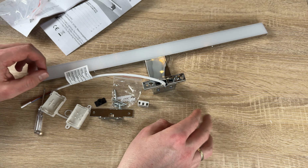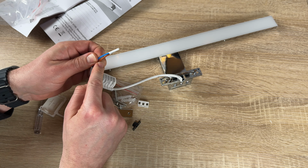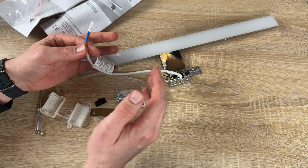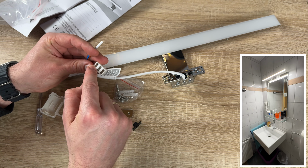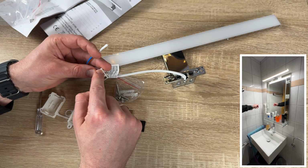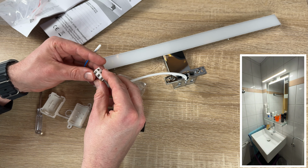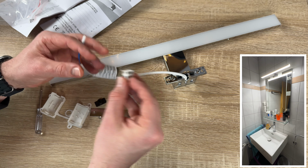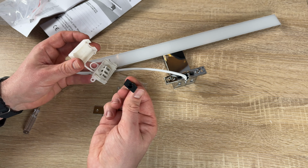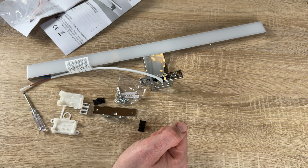It's the brown cable, and of course the blue cable. Earth is not recommended, so we do not have to install this. It's easy, as you can see, and it makes a really beautiful and modern looking bathroom after you install this DILUMEN LED mirror lamp. This is the Lisa 300, or you can also use the Lisa 500 with that. The voltage is 230 volt, 50 Hz, maximum power is 5 watt or 10 watt. The isolation class is 2.